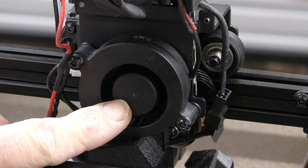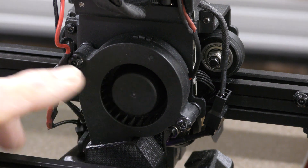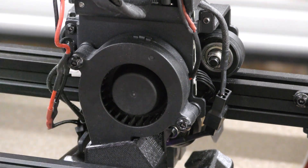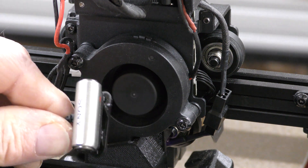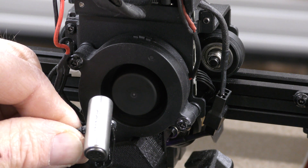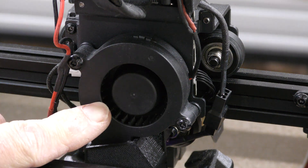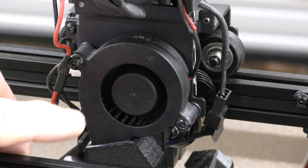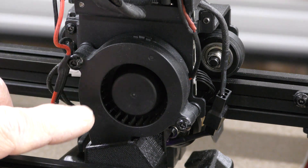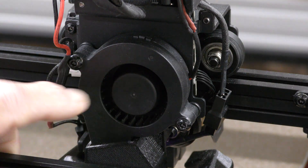One of the things I didn't change was the blower fan on this, and this thing is pretty loud at full speed. The reason I didn't change that is because I really want to show how this machine works with mostly stock stuff when adding Klipper to it. I might be changing this out eventually for two 5015 fans — my buddy Nathan from Nathan Builds Robots has designed one called the El Pablo — but I really wanted to have this thing tested with just a stock fan.